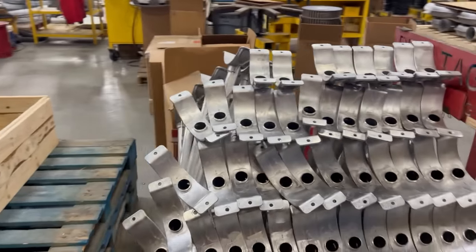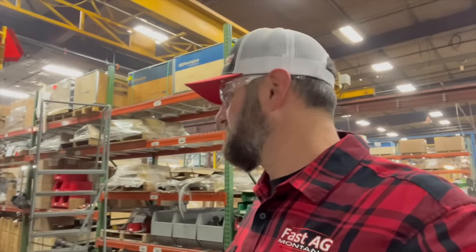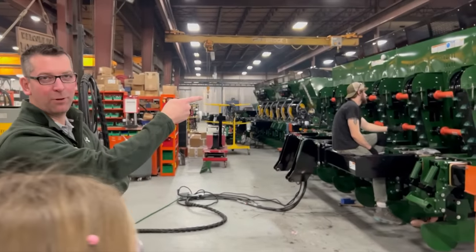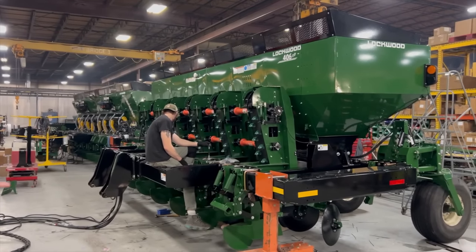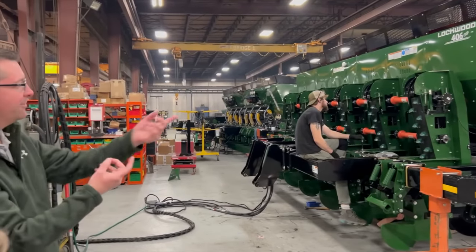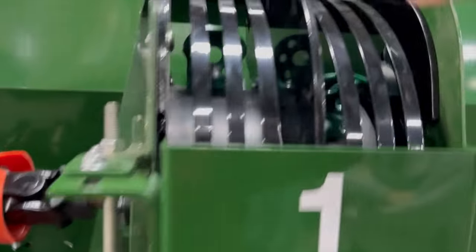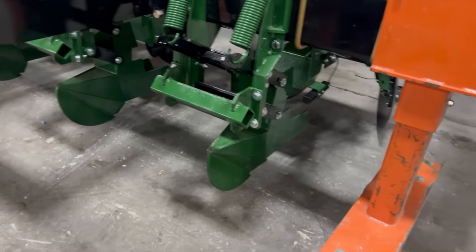Those tile plows look familiar — we could use one of those for about three hours and take care of all our drainage problems on the farm. You put it in the back of a quad tractor and put tile down through the boot out the back. Over here is the potato seed planter. The seed tank is at the top, potato seed goes in there and drops into the seed bowl. The cups come around and pick up pieces of seed, ride around, and drop to the ground. It's basically like our boot on an air drill to open the ground.